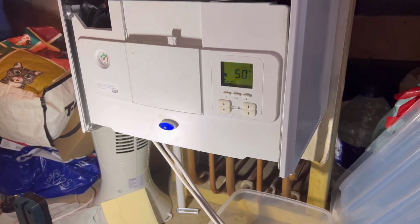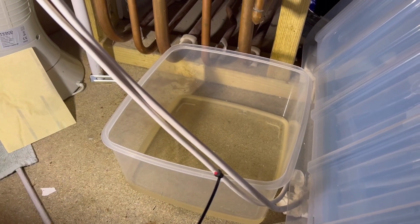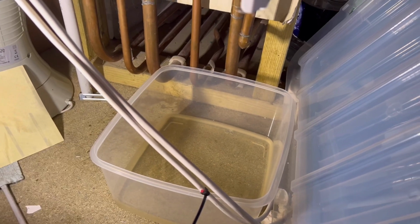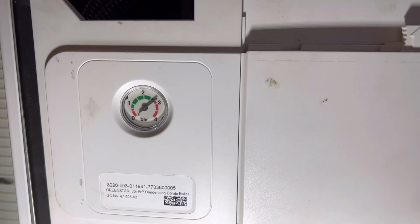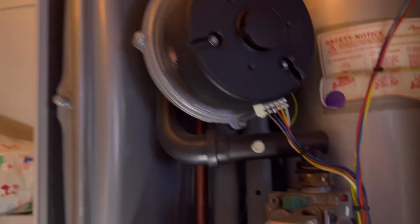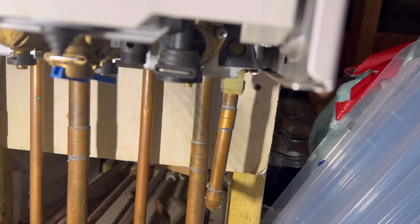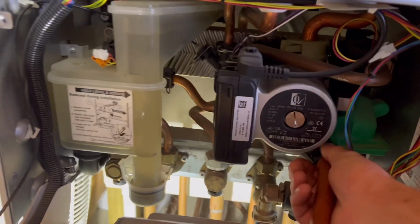Right, so on this one, basically the customer hadn't reported any pressure loss, and the time that they actually booked the appointment was about 3 or 4 weeks ago, which was when it was cold. They also said that the condensate had frozen. So I think it was down to the condensate having backed up into the boiler and then flooded out, because there were no other leaks on there, and obviously I've done the expansion vessel.